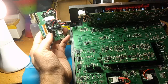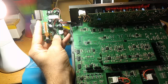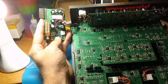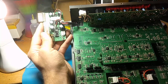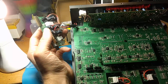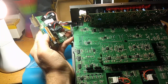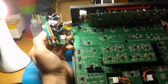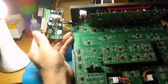I really like it. And what really tipped me off to why I needed to fix this power supply is the bridge rectifier stage. Bridge rectifier, just 4 diodes. But you'll see here there's 8 diodes, which means we have 2 bridge rectifiers, which means we likely have 2 AC inputs. The other tip-off is you have a 3-pin plug, both to this board and to the outside. I was kind of hoping one of those would be an earth ground or something, but no, it's dual voltages. So there's actually 2 16-volt AC power supplies.